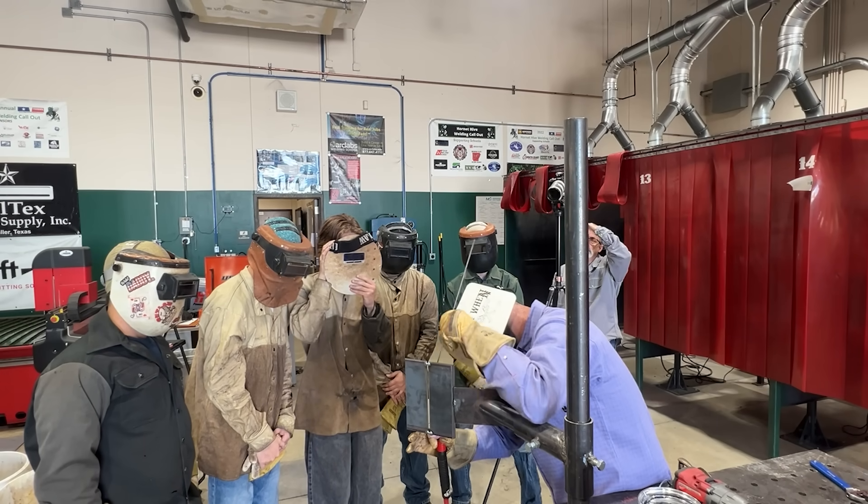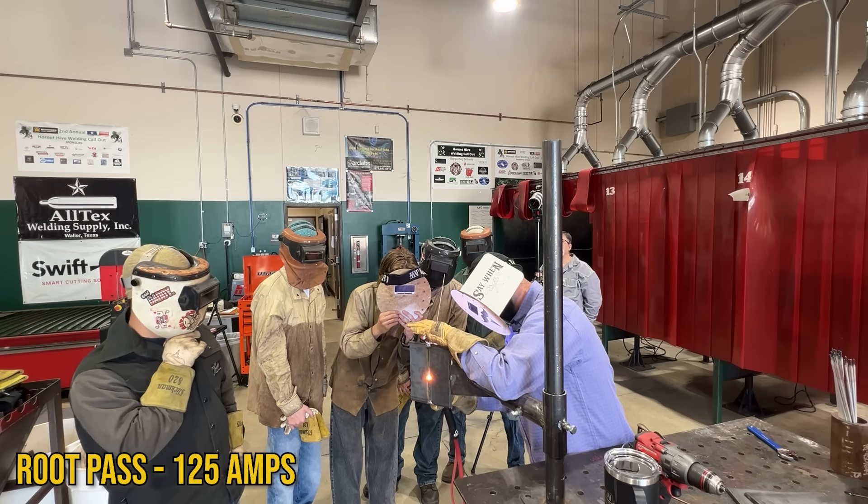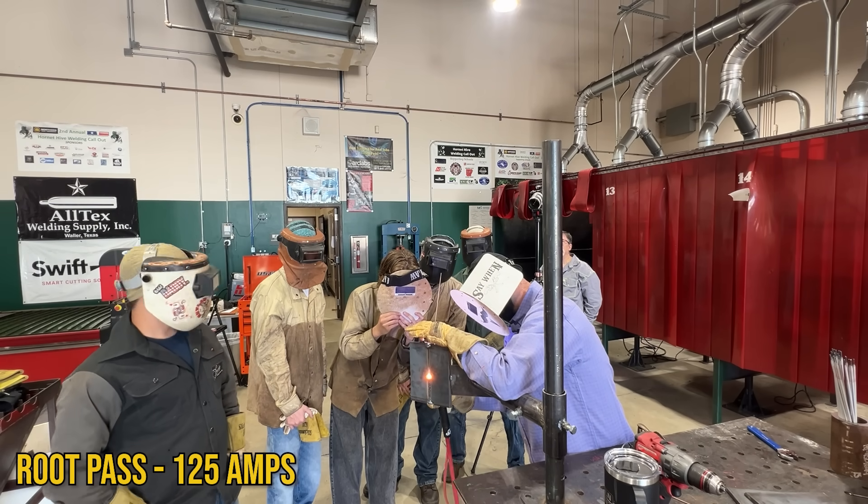I'm going to touch the plate with the wire, sit on it, get it nice and hot, then introduce filler metal — doing just the tiniest little steps. The biggest thing is giving that rod time to soak in — slow and steady. You can see my thumb on the filler metal; I'm applying pressure. With this eighth-inch gap the wire doesn't go through the actual gap, but I still need those edges to break down. Your root pass should not be wider than the gap that you have.